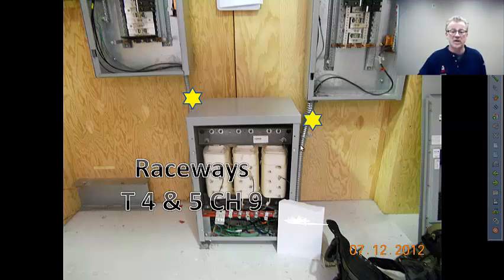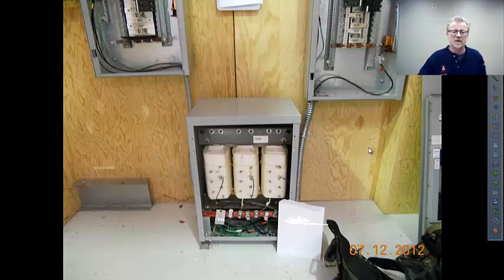Watch to make sure you're in the right columns and using the right wiring methods. So that's really it: check out the transformer KVA, calculate full load current, look at your grounding electrode system to make sure you know what rules apply for running your grounding electrode conductor. Investigate the rating of the panel board — whether it's a main lug only panel board, six grouped overcurrent protective devices for an industrial installation using the tap rule, or the most likely scenario where you have a main breaker or single set of fuses. Check out the rating of that device — its temperature rating, terminations, and trip rating.